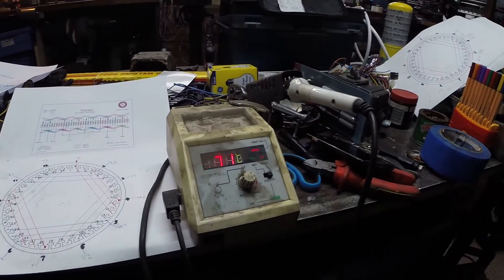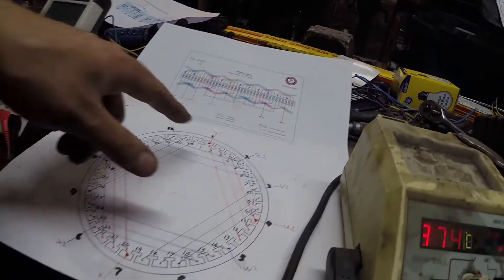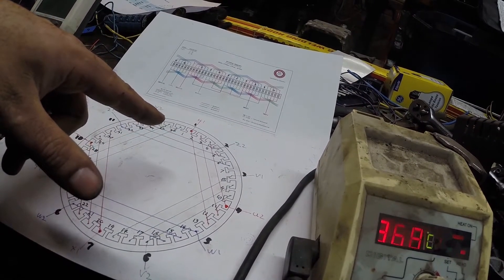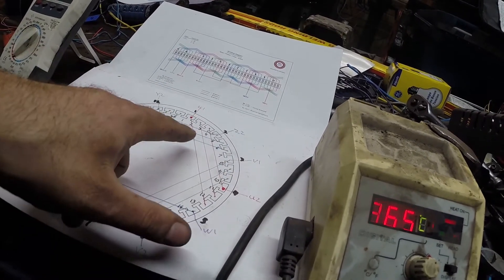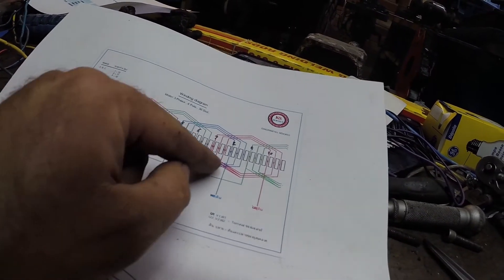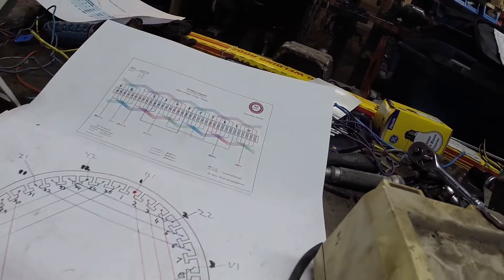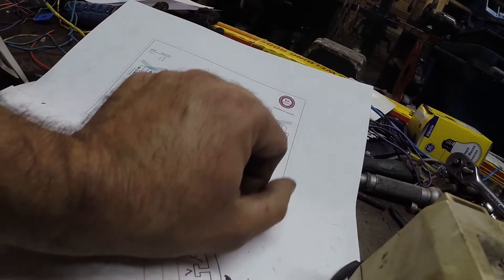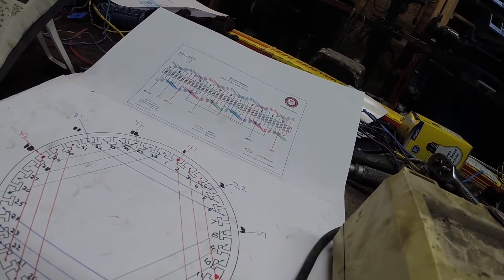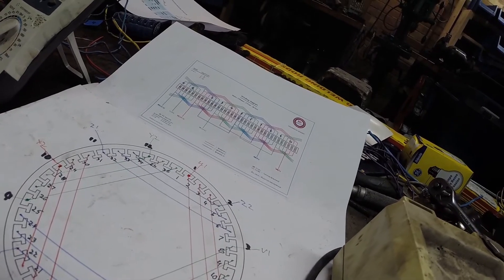Well, I'm about to start soldering. A question crossed my mind. We've got these pairs of windings here. I did wonder whether we should have them as different polarities each side, but if we follow the diagram here, they're actually wired outside to inside to outside to inside, which implies to me that if you put voltage across those, they're both going to be essentially the same polarity. So all we want to do is break that, connect that to there, and that to there. We've got the same polarity but we've got double the voltage over each of the coils, which is what we want to run on a lower voltage. Let's give it a go.